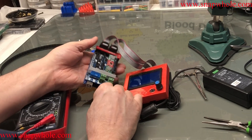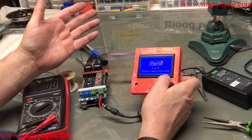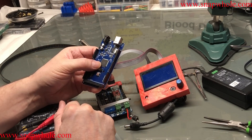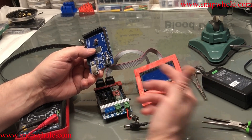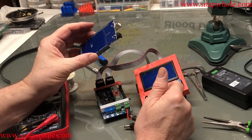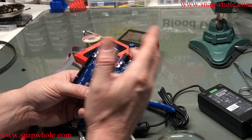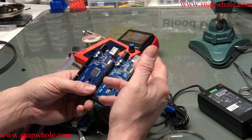Excellent. The ultimate thing is going to be, can I just plug this in and it'll work? Yeah. So this is good — this is working okay. So there you go: quick and dirty and very ugly repair of the 5-volt regulator. Now that was surface mount parts without really using surface mount techniques, but it worked. I'll do another video where I actually do it right and post that. I replaced two of these and brought two of these back from the dead. Now I could have used them for other uses that didn't have to have 12 volts on them, but now I can use them as RAMPS boards, and I've already programmed them — they'll come up.